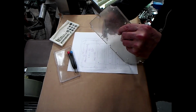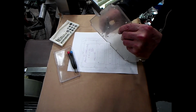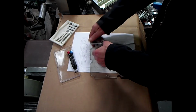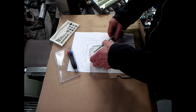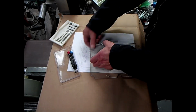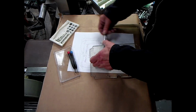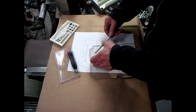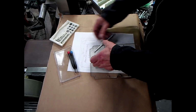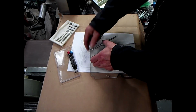One set of contacts opens the E-stop circuit to the controller. The common terminal of the other set of contacts goes to the live transformer input for this box. The normally closed contact is connected to the spindle's live supply, which is also fed through the current sensing chip. The normally open terminal connects to an alternative main supply. This contact arrangement prevents this new main supply from reaching the spindle.